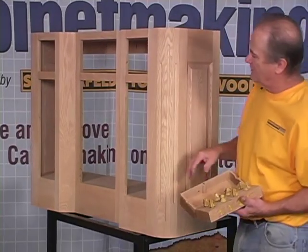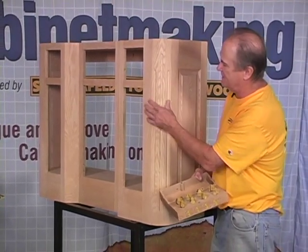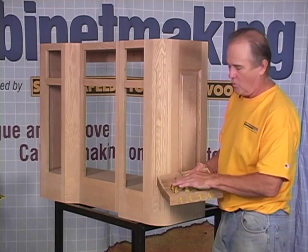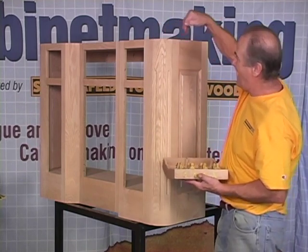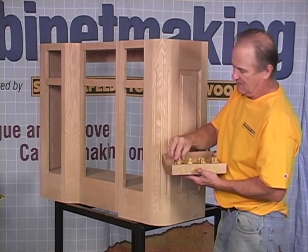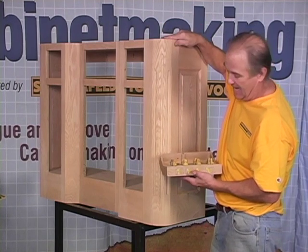Okay, today you can see we created this angle right here, and this is our large angle. We use a little bit wider pieces, and we used 11 1/4 bits. Now, if instead of just doing a 90 degree corner, if you wanted to go around a half or a full circle, these 11 1/4 bits, you could create a whole circle with 16 sides.